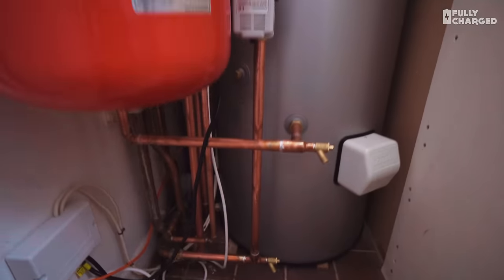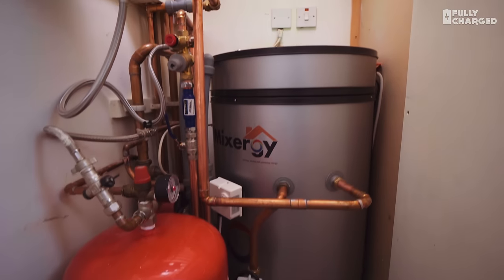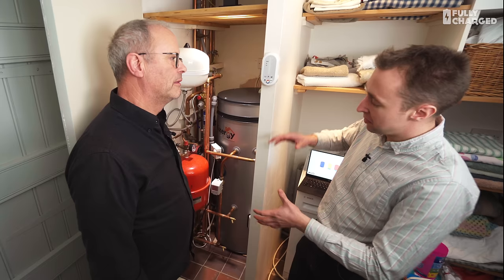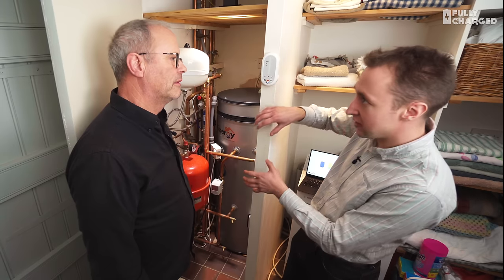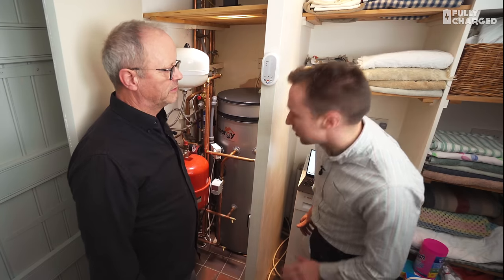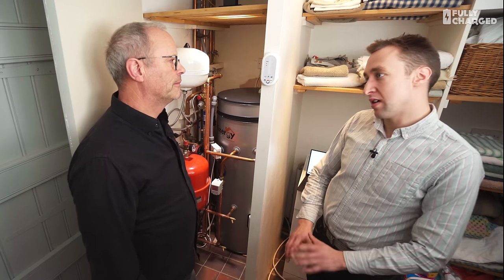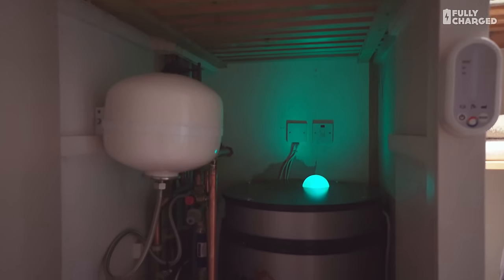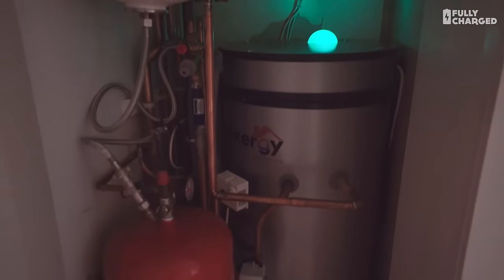In case people don't know, these are pressure tanks. These are part of your central heating system. But for all intents and purposes, it's the same connections as a regular tank. So we're trying to cram all this stuff that's on board this cylinder, the computer and the control and the sensors, within the same envelope. And they come in different sizes. Is this a bigger one? This is a mid-sized one. A relatively small unit would be 70 litres, up to 250, 300 litres or beyond, depending upon what you're doing.